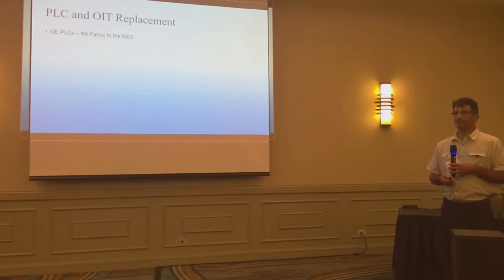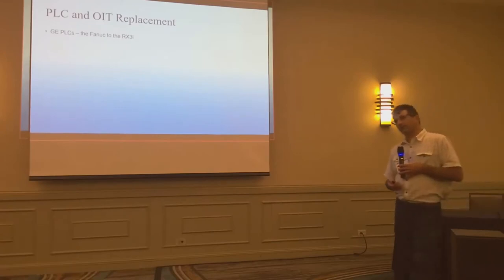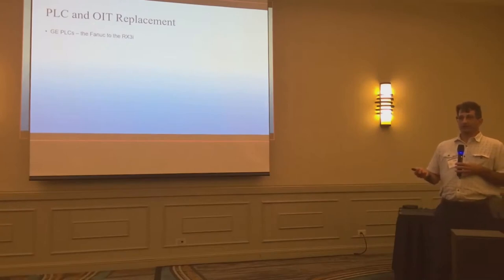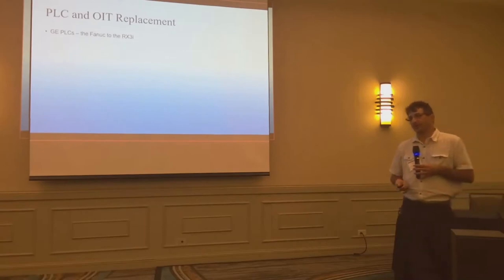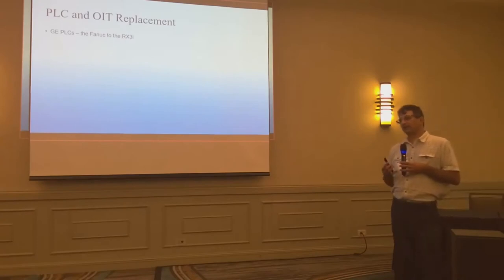So on our real view, we have two temperatures, online and offline. Do we just set that for one? You can do that. The other thing you can do is to lower it so it's still above the offline temperature, so it's still above the acid dew point, so you've got 350. For your online, you can make it 250 or 220. This would be safe. And then again, if you're not having any problems and your signals are working, what we think is it has a lot to do with the response time of the sample line.